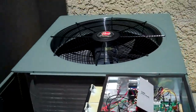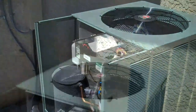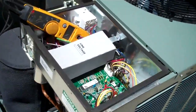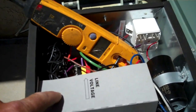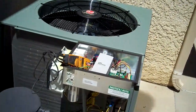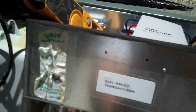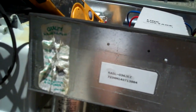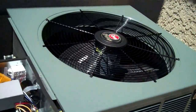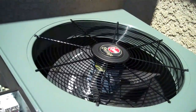We're going to amp it out. I'll show you what the 18 SEER does — it doesn't pull that much power. Okay, here we are at low stage. We're running 4.9 amps on low stage. I'm going to bump it to high. They just kicked on high — 30% more cooling, fan speed kicked up. My amps right now — reading 6.9 on high.